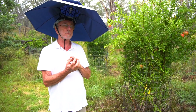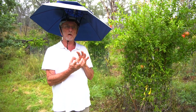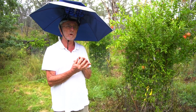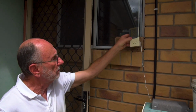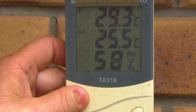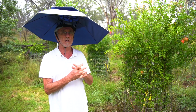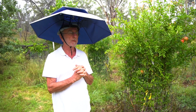You also need to be aware that a cow's stomach operates at body temperature. So that's probably the ideal temperature for a biogas digester to operate at. However, they seem to operate quite fine down to about 20 degrees centigrade. So 25 degrees is fine. Once you start getting down below 20, then you can run into problems, and it can actually shut down over winter and stuff.